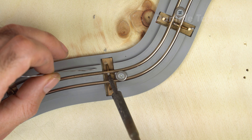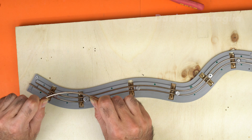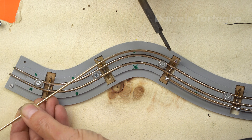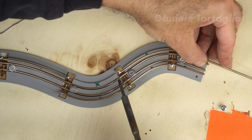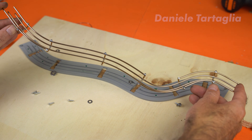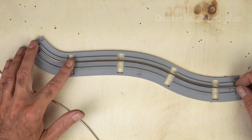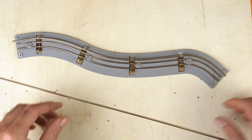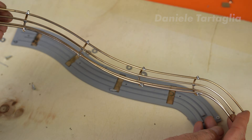The soldering technique is the same, but this time everything is done directly on the jig. It fits perfectly — absolutely perfect, even better than the first one. Finally, the last and shortest wire form. Same technique, but without press fitting the rods — I pre-bend them manually to avoid spring back after soldering. This one turned out perfect as well.